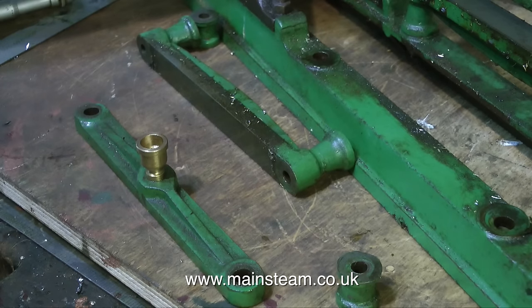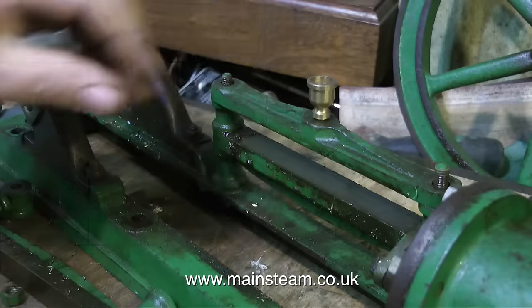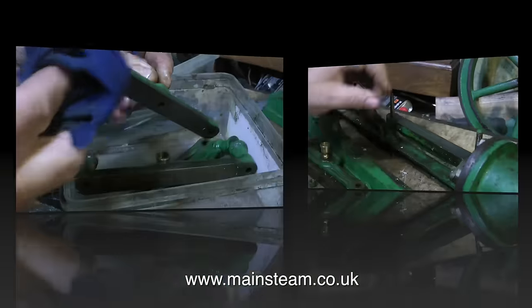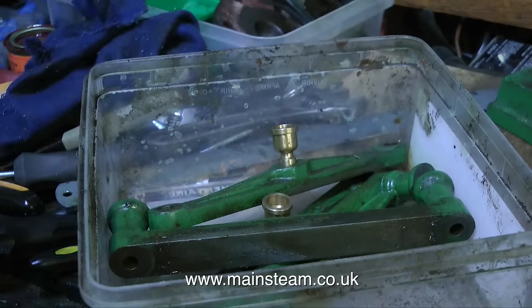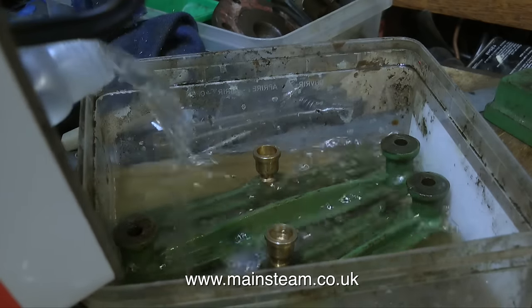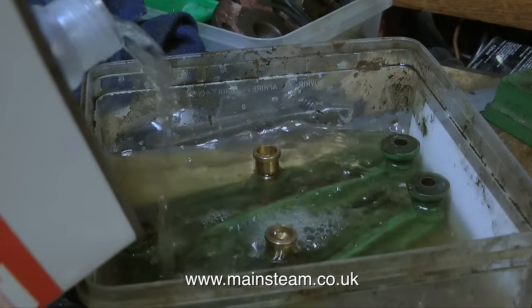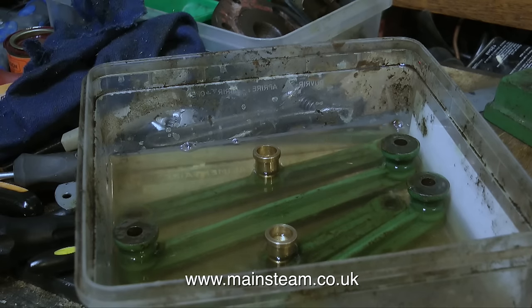What I will probably end up doing is making a separate video on the subject of how to make a steam engine crankshaft. I will also of course include it in this series but in less detail. As in previous videos, I'm putting all the parts into a polythene container and half filling it with some cellulose thinners. What I'm going to do today is just leave them in there. Normally I would scrub them off with a paint brush, but there's no point because the paint will just fall off after they've been in the thinners for a while. Then with very little effort, a simple wipe with the paint brush and it'll be bare metal.